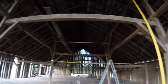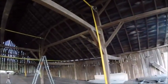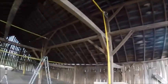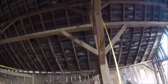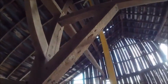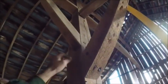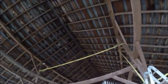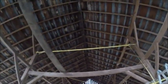Like I said, they're going to have 25 feet in the middle. These posts are going to come out, these 16 footers. Kind of a shame. Most of that bracing's pretty nice looking, but it's not all that awesome either. I mean, these here have had some bees bored into those. That one there, that's added. I guess they like the taste of that, but they haven't bothered this oak. It's still good shape, but those cross rails, they'll be in there. And then I'll take these pieces out here. They'll go to the top to help brace that and give a little more support over top of the bridge.